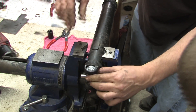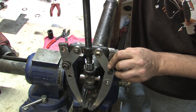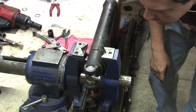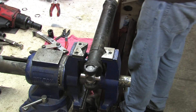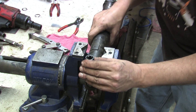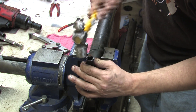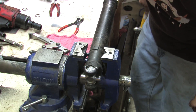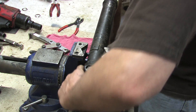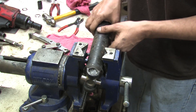The snap ring feels awfully loose. I'm not sure we have the cap all the way down, so we're going to try one more time using something stronger than the vise. After that attempt, it went on the front side but not on the back side — so we're going to give it a light tap. It looks like the snap ring is binding too tight, so we want to go with the thinner snap ring on both sides to give it room to seat.